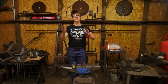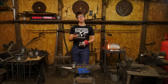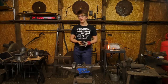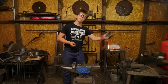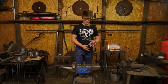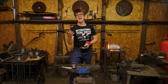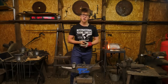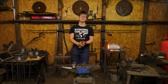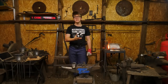And when it is hot material and when you have such a shallow angle of an edge, such a thin edge with this taper, it means that when we forge, we're putting all of the work into the material rather than into the anvil. It's just like if you were to take a top hot cut and compare it to a flatter. Strike the same amount of blows as hard as you can on a top hot cut cutting hot steel, and the same amount of blows as hard as you can on a flatter striking a hot piece of steel. What you're likely to find is that the mushrooming on the flatter is going to be much more severe than on the top hot cut, as when you strike that top hot cut, that hot cut is moving straight away into the material. Same thing with the anvil. Your material is moving straight into the hot cut without as much energy being dissipated into the anvil.